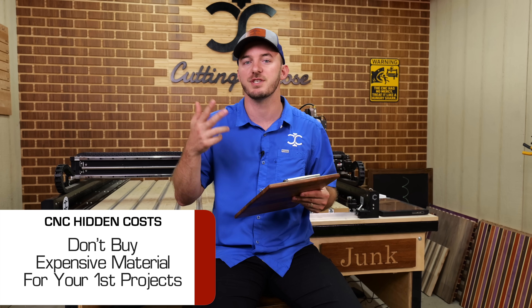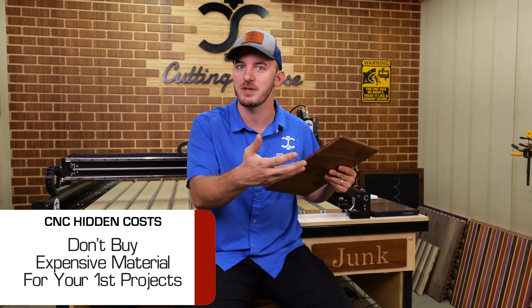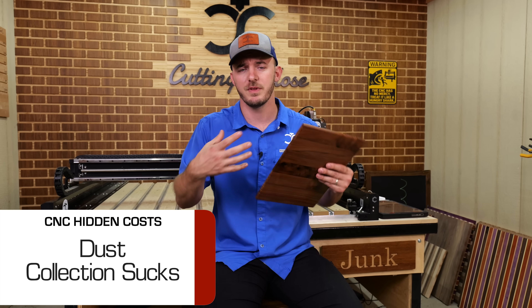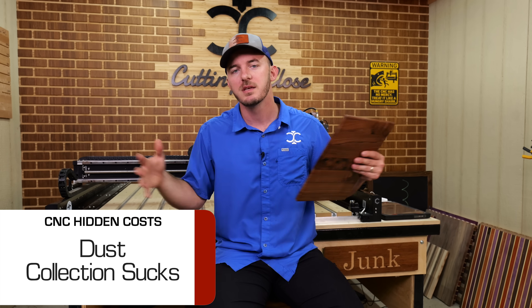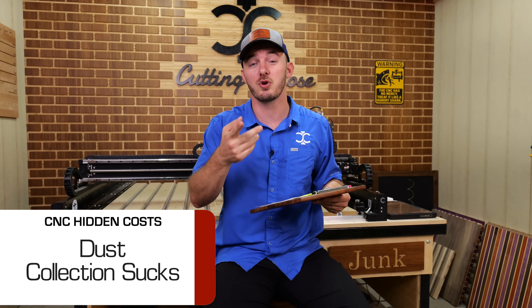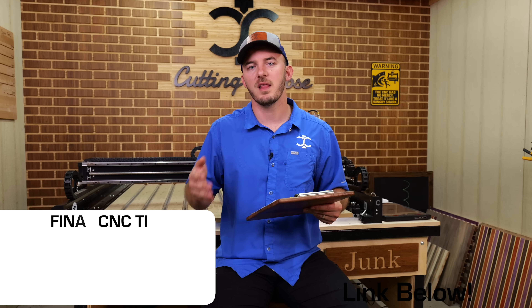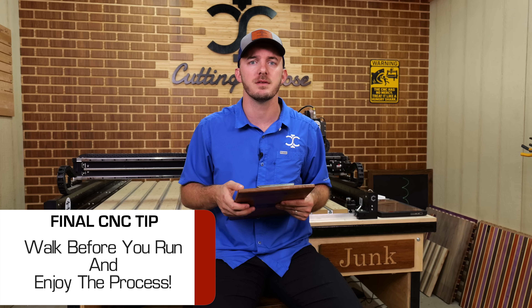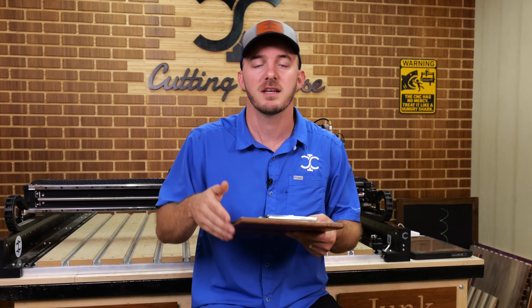Third, don't buy really expensive material to start — use foam, MDF, or cheap pine or plywood. If you start with walnut, you're probably going to mess up something expensive. Fourth, dust boots suck figuratively and literally — dust collection will be about 80–90% effective, not perfect, so expect some extra dust unless you build a complete enclosure. There's a cool dust boot by WoodPro Designs with a light and laser — check that out. Last: walk before you run. Many members overbought on gadgets. The minimum you need is a bit, a CNC, and a dust boot. You can always buy accessories after the fact.